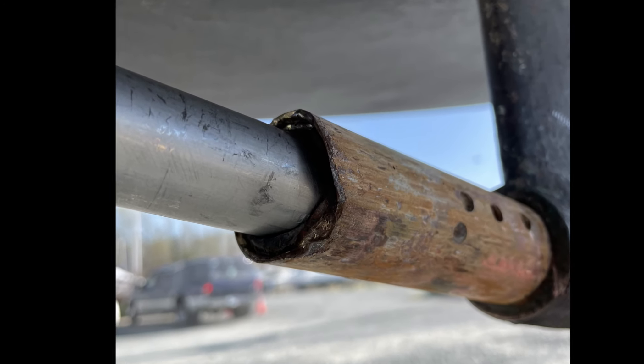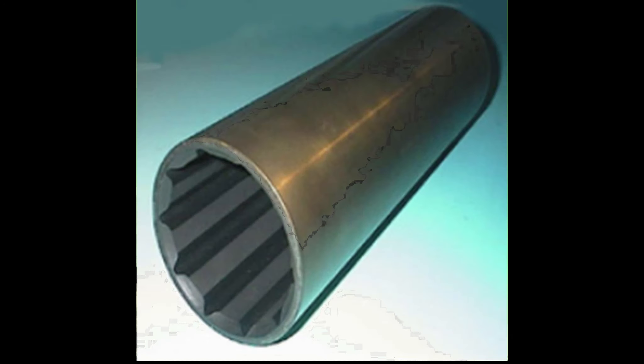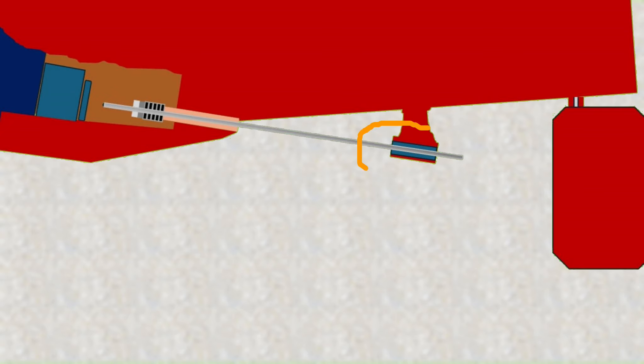You can see why the collets would not seat on the forward end of the bearing. The lesson here is to go slow — a quarter to a half turn on each bolt at a time. It was a simple matter to press the new bearing in with the Strut Pro. With the cutlass bearing done, it was time to start putting everything back together, starting with the shaft coupling.